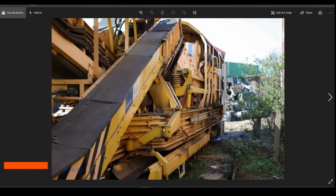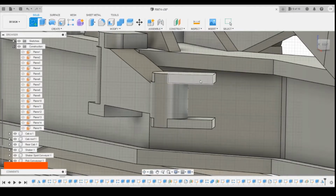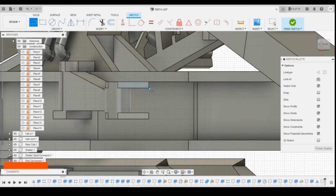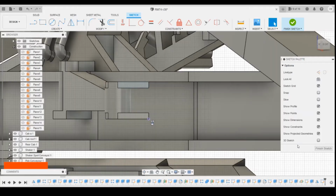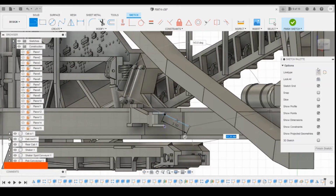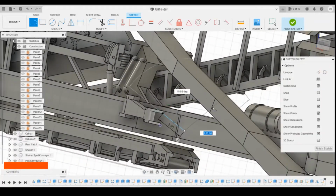Okay, so now we're going to draw the diagonal, and looking at it, the top surface looks like it becomes level with the bottom surface. So I'm going to draw on this front face here. I'm going to draw 2 parallel lines. I want that to come down to the bottom surface, which it hasn't picked up, so we'll do a project at that point there. And then we'll come down from here, so we can project into that. 3.5. Maybe a bit too far. We can come back to that in a minute.